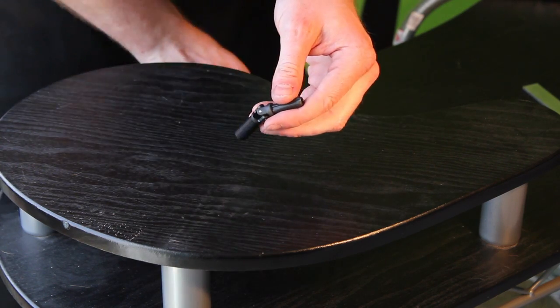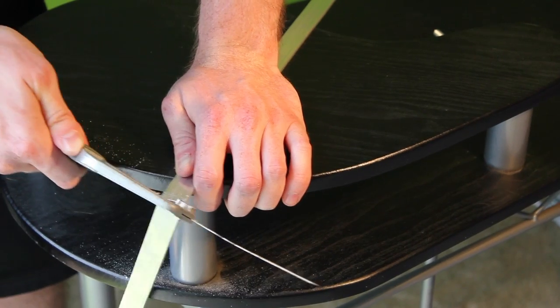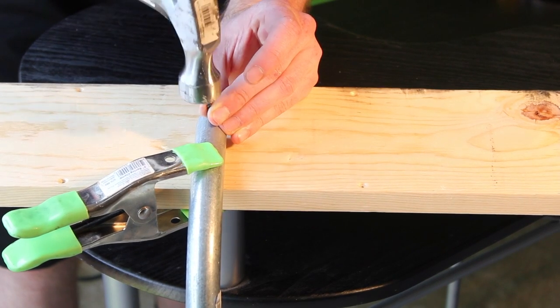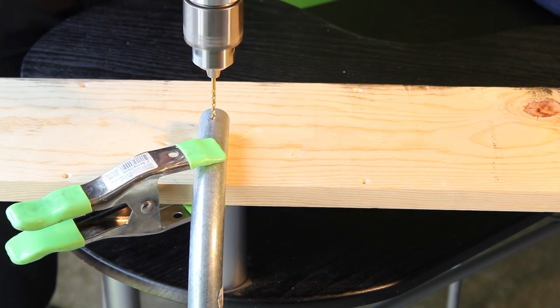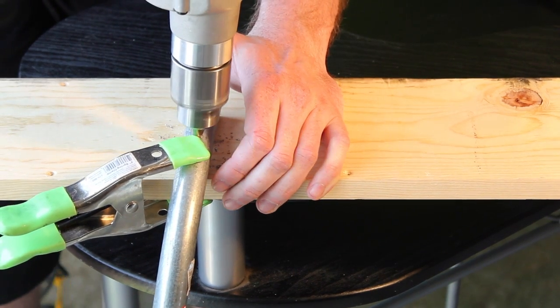The first thing you need to do is use a pair of pliers to assemble the Traxxas gimbal. Next, cut off a seven and a half inch piece of aluminum. Drill two quarter-inch holes in the first piece of conduit and two quarter-inch holes in the piece of aluminum so that they match up and you can bolt them together.